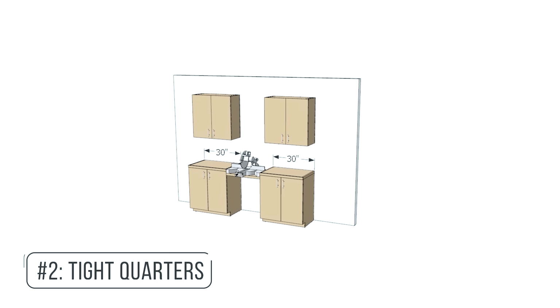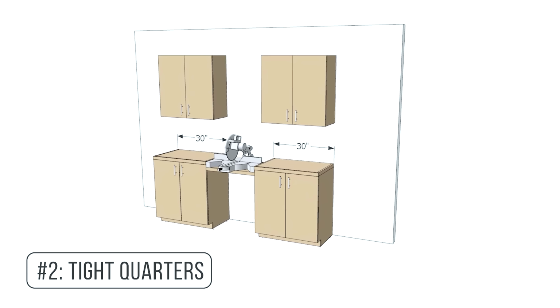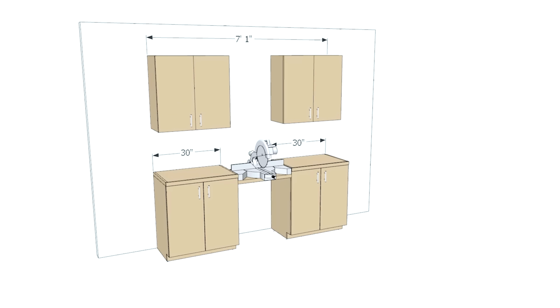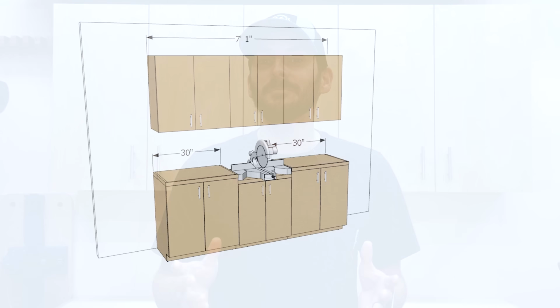Now here's a setup if you're tight on space. With 30-inch cabinets on either side of the saw, you'll come in right under 8 feet of wall space used, and you'll be ready for 8-foot boards. Now of course you'll want to fill in and use that space under the saw and above it, and I'm going to be figuring out what that looks like for my setup on the next video.